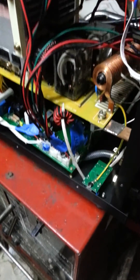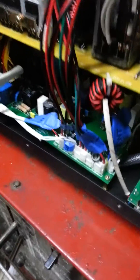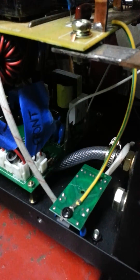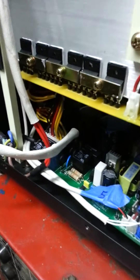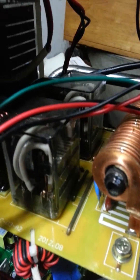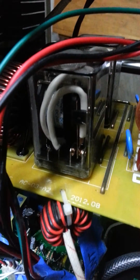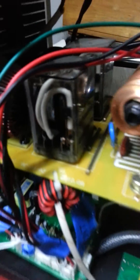When I'm arc welding I can weld, but when I try to go to TIG, nothing seems to happen. I press the handle, I get that high frequency, and I think I can hear a relay — maybe a power supply relay. Nothing's happening on these two big contactors, though I do know they work — they do trip when you go to arc welding.